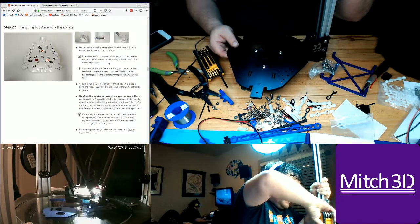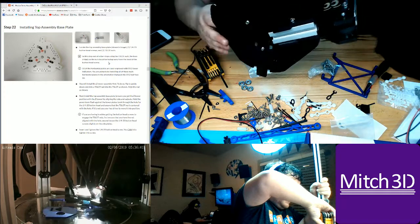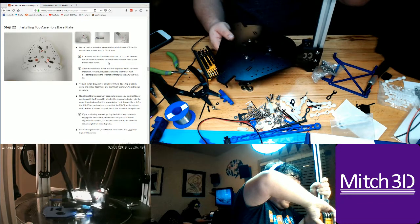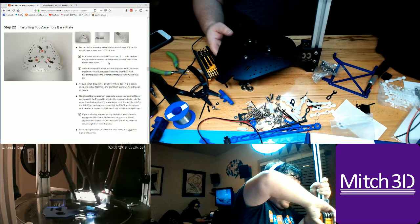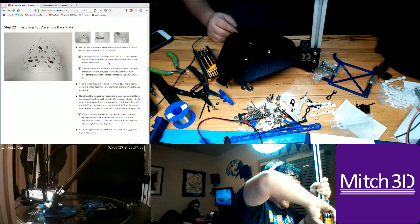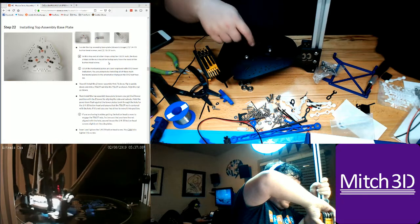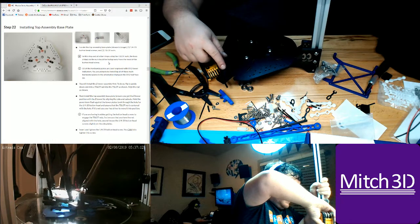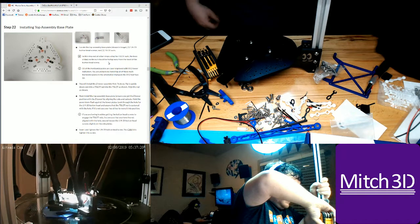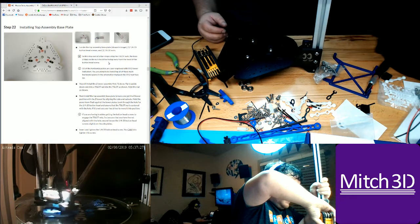The thing is that you have a top and bottom section that's going to mount on both sides of the extrusion, and you have these short extrusions, so it actually does feel pretty stiff. But again, all the tension is on these plywood pieces. So I think the next step for me is going to be making all the panels out of aluminum, because it's totally doable. They're all 2D cut. All I have to do is water jet them and then add some tolerances for the radiuses, so the parts that need to slot into each other actually fit tightly. And since they're aluminum, you can get tighter tolerances than plywood.